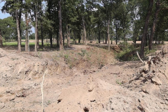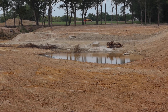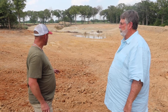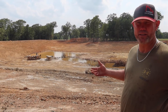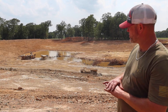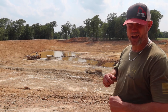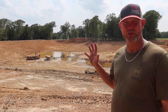First of all, Bob, we got this pond down to depth, and then we started getting these shallow areas. Once we had this water, we figured out where the water envelope was going to be on the shoreline, and we excavated down to depth where you wanted us to dig, basically creating levels of elevation underneath the water. We also built tic-tac-toe structures for habitat. We took the logs, cut the trunks of the trees into equal lengths, then made a tic-tac-toe structure — placing three big trees down parallel, sitting two on top crossways, and so forth. To tie them down so they won't float, we used 16-penny nails and baling wire, and wired them all together. By doing that, we haven't had any structures float before.